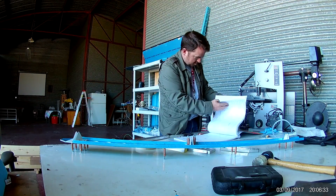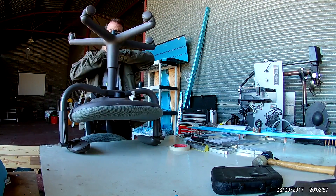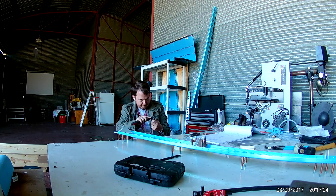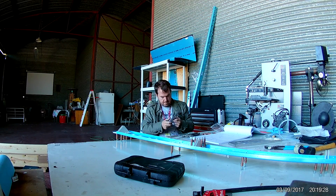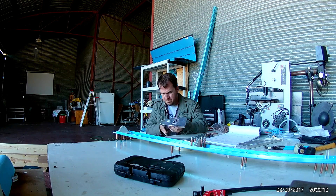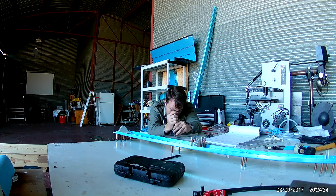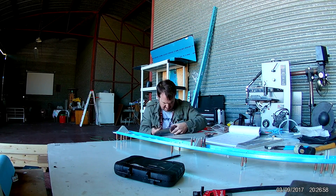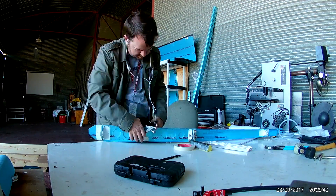Fluting I have found to be a very simple process. You have to lay the pieces flat — I use the table — and then flute accordingly until it is perfectly flat to the table. All of the internal ribs to the horizontal stabilizer I am sitting here meticulously filing down. I have both a regular pull-speed deburring tool and a nice set of Craftsman files, which I love. The aluminum files do work really well, but I also have a steel file that does a good job of removing material when I need it. Here I am fluting very carefully, very slowly, a small amount each time, and then laying the rib back on the table to see if it is flat or if I've overbent it.